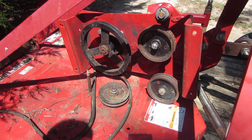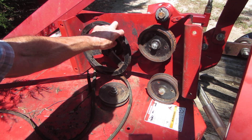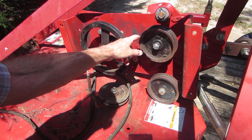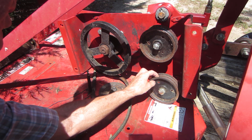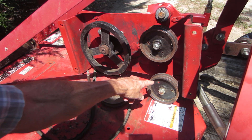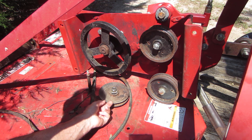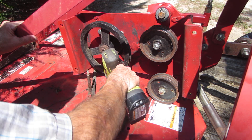What I'm doing today is taking off some of these pulleys so I can order replacements. This pulley, thankfully, is cast iron so it doesn't rust as bad — surface rust is about all you'll get on that. But these other pulleys are rusted through right here at the edges. This one down at the bottom has a rust hole all the way through the running surface, and this one has a lot of rust on the surface where the belt runs.